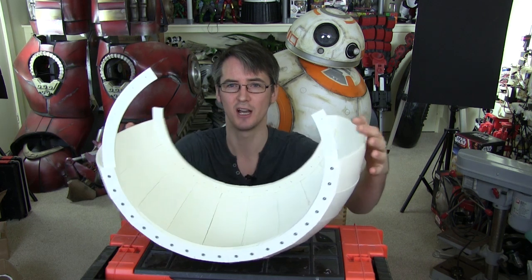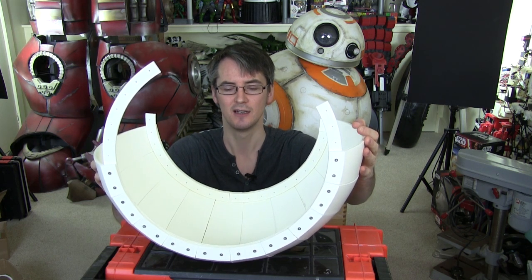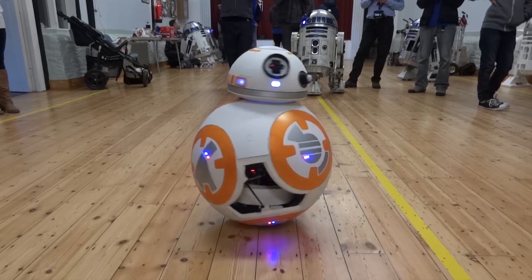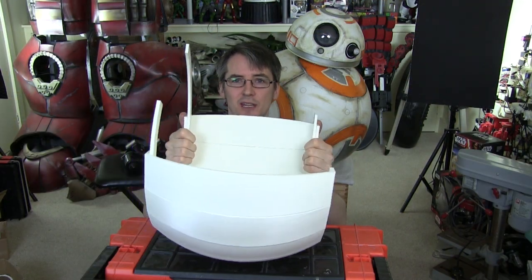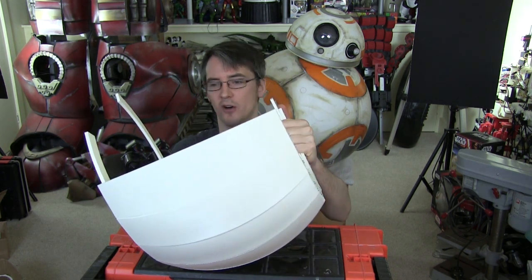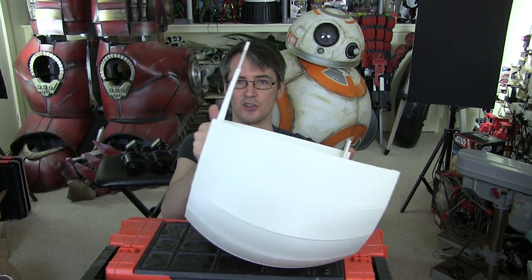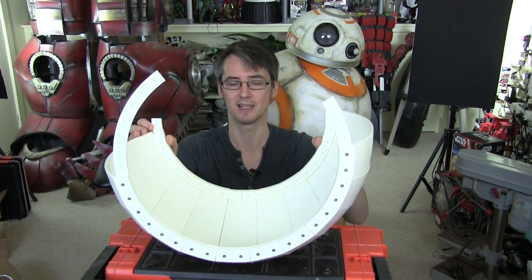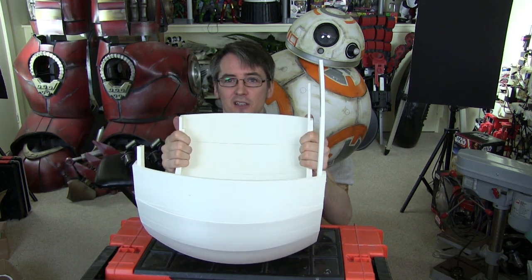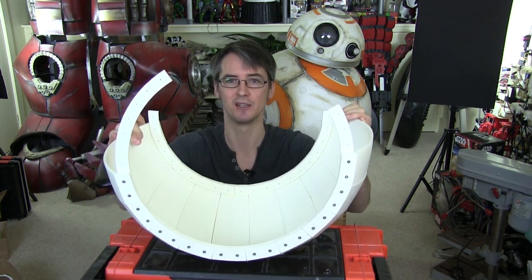In the previous version I had essentially a hubless wheel that allowed the ball to drive forward, and then I'd implemented a flywheel inside filled with two pence pieces which allowed the droid to spin on the spot - especially if I ramped up the flywheel in one direction and then kicked it back the other way. What I neglected to put in was any form of ability to shift mass sideways so I can bank and turn - a bit like leaning on a bicycle - so that if we offset the main axis, the droid will go round in a circle. This time I'm going to build another axis that allows it to shift, which will also help with dynamic stability.